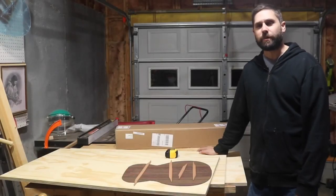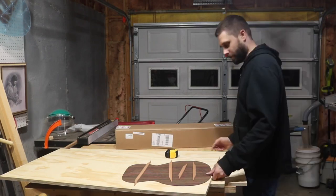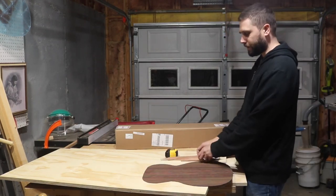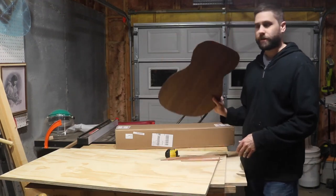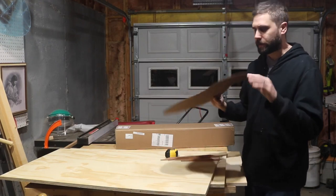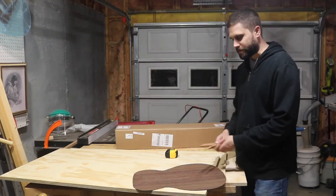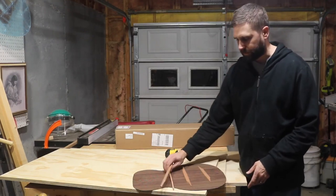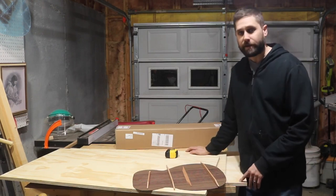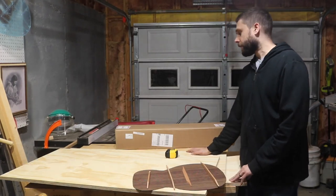What's going on everybody, my name is Chris, welcome to my channel. I'm in the middle of an acoustic guitar build — I just kind of started a month or two ago. I have the back made out of two pieces of Indian rosewood, joined together and thinned to where they need to be. I'm taking some mahogany and made these braces that need to go onto the back of the guitar, glued down to it. The way I've chosen to do that is to use what's called a go bar deck system, which I'm going to be making in this video.